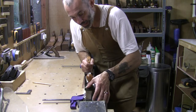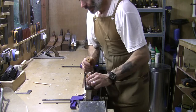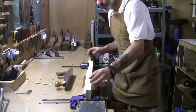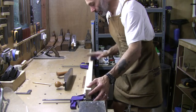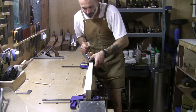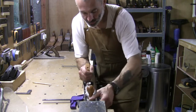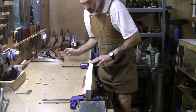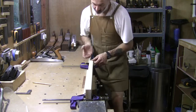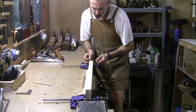But as we come out here, I let this one go virtually altogether because I find that when joining, it's even easier to basically create dents in here, and then it's going to get a ripple, and then you see that it's going to drive you a bit potty. So from here, engage and let go. So in this way, we're making sure that we're engaging correctly, and when the plane blade is presented to the wood, it's not going to be at a skew to then ruin this corner.